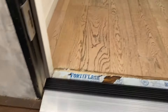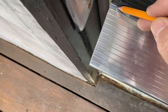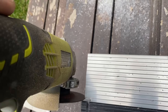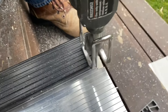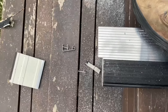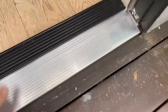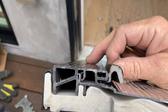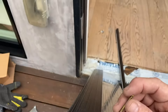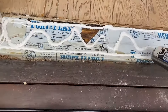With the length set, I'm going to mark where I will notch it for a custom fit. Now, because this threshold is no longer attached to the side jambs, there's a chance it could bounce up and down. Here's where the weather stripping goes — there's a groove right there. We can pre-drill and shoot some very thin screws in on an angle to keep this thing in place, and of course we'll cover this with caulk first to keep the waterproofing intact.